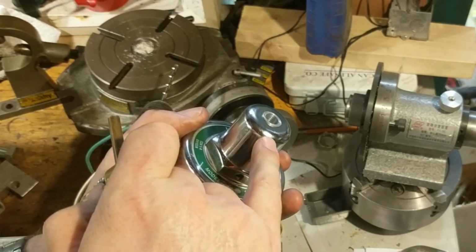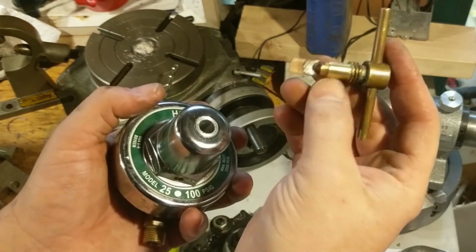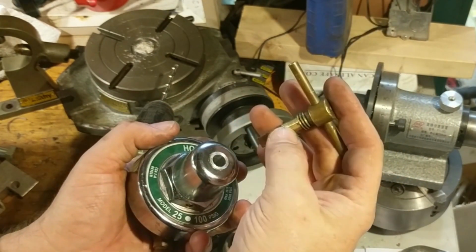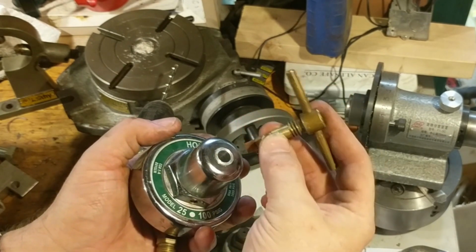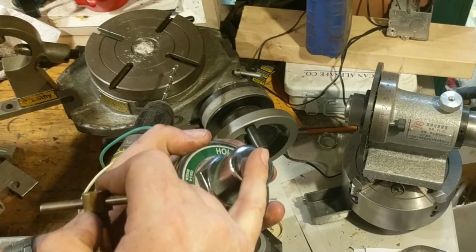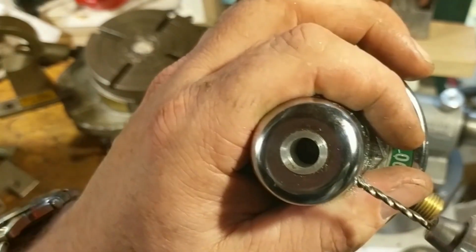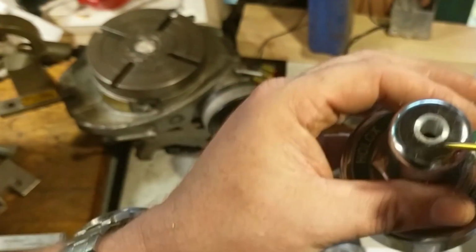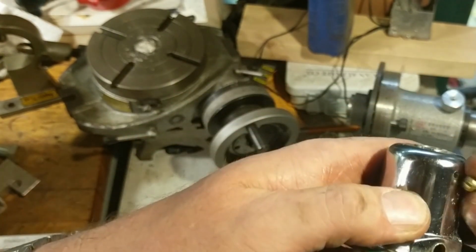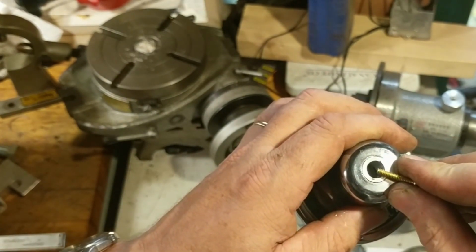Underneath here, I'll drill a hole all the way up through the housing, through the bushing, and I'll have this in place so that I can see where it gets engaged, and then I will put a ring on this at that location so that a dog screw that screws up in there can go into the slot and retain it from falling out. I'm just going to use a brass flathead and I will clip this screw off at the correct length so that I can bear down the head against that casing and it'll be tight against the casing and be engaging the slot the appropriate amount.